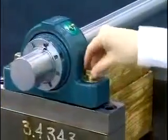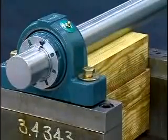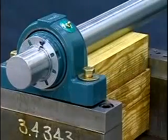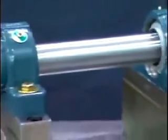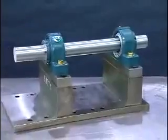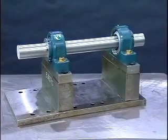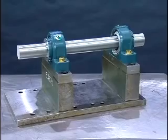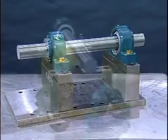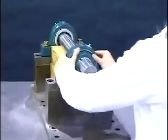To keep the housing in position, loosely install the base bolts. We'll now mount the float or expansion bearing. The float or expansion bearing is mounted the same way as the fixed bearing. The only difference is positioning the housing with respect to the bearing to accommodate shaft growth due to thermal expansion and the movement of the bearing during installation. Follow the same mounting procedures as shown in the previous segment.